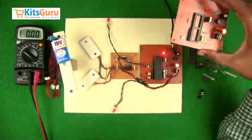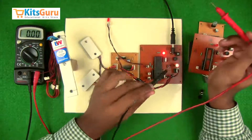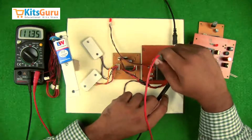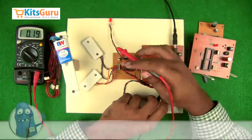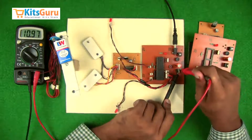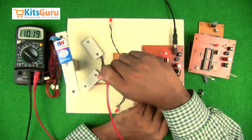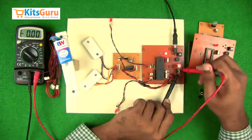After completing the assembly, check the power supplies using a multimeter. The black terminal is the common terminal, connected to the body of the voltage regulator IC. The first pin of the IC should show the input power supply voltage, and the third pin should show five volts. The 40th pin on the microcontroller should also show five volts. For the parallel power supply, the pin on the inside is the positive terminal and must be connected to the corresponding positive pin on the other connector.